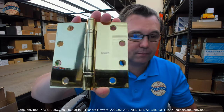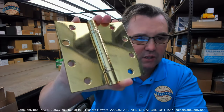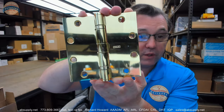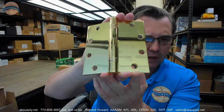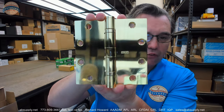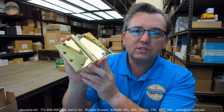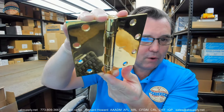The short version is that it is a 5x5 hinge made of solid brass with a polished brass finish. You can always tell an actual solid brass piece of hardware because its sheen is distinct and far more elegant and natural looking. Solid brass or solid bronze products have a warmth that really can't be mimicked by plating over steel. You could do this hinge in steel from Stanley — it would become an FBB179 — but when you are looking for solid brass it would be a 191.